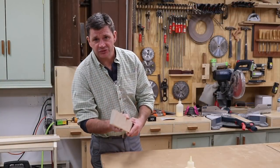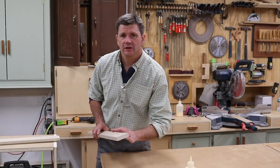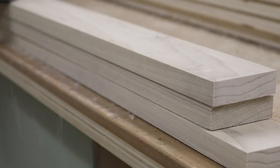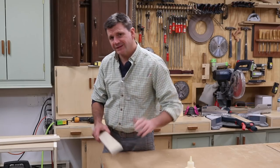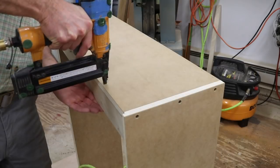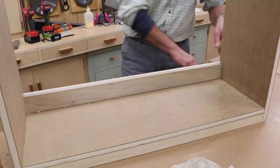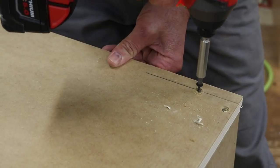The next step is to add supports to the back of the cabinet — one at the top and one at the bottom — and for this part I'm using solid wood. This is how I'm going to anchor the cabinets to the wall by screwing through the supports. I also put a chamfer bit in the router to add a decorative edge on the support — not necessary but a nice touch. I'll attach the supports with wood glue, a few inch-and-a-half nails, and a two-inch screw through the side into the support.